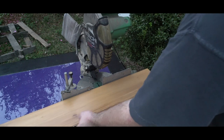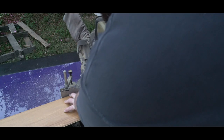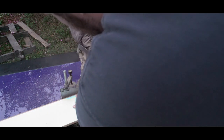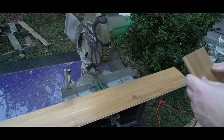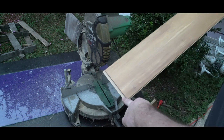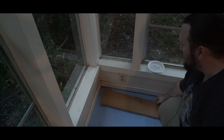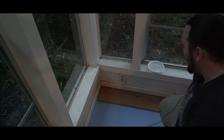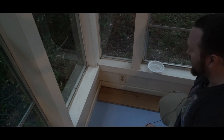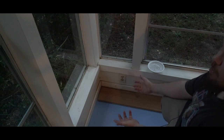So I'm about to cut my sacrificial piece from the side that I'm going to put towards the wall. This is going to be the piece we use to tap in the other planks if we need to, and I have a rubber mallet for that. The reason we don't want to cut off this other side of the board is because that's where our next plank has to go and snap in. So this will be our first plank. Leave about a quarter-inch gap between the board and the wall — your baseboard is going to cover it.